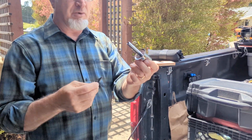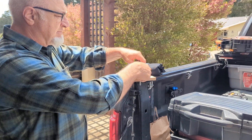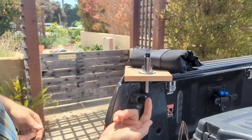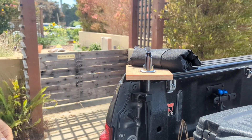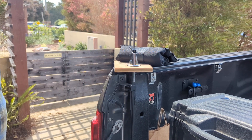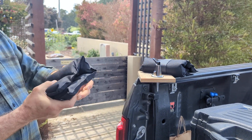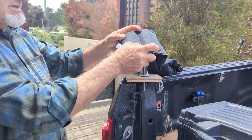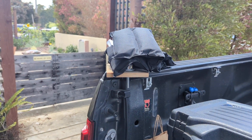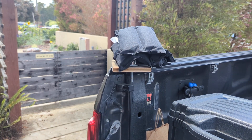I put on, of course, the metal washer — I'm going to leave this on because I'll be using this later — then the little rubber, and then it comes up to the top. Now the thing is, once I go into that cabinet and start trying to put a nut on here, it's going to be pushing it all over the place. So what I came up with — and this is like a mock example of a countertop — was these ankle weight sandbags. I put a nice weight on top so that when I push from below, it's not going to go flying all over the place. And it's soft material, so it's not going to mar the finish of the faucet.